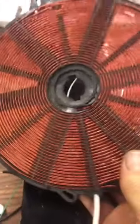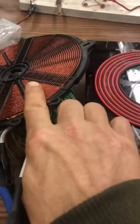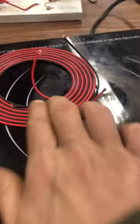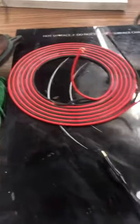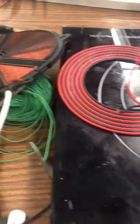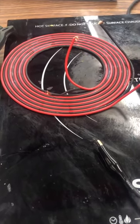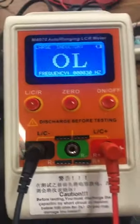So at any frequency in that range the coil was resonant — it would produce a sine wave resonance no problem. The same is true with these coils. There may be some variance between the bifilar and the mono-filer. The one I'm speaking of at 2.5 megahertz was a bifilar coil, and when I hooked up the earth ground I tested it as well, and again it was resonant through all the bandwidth.